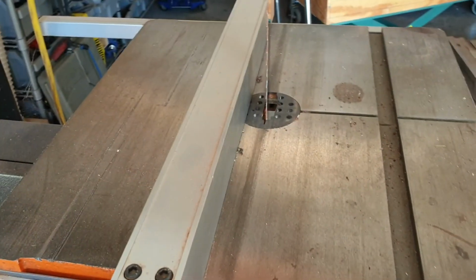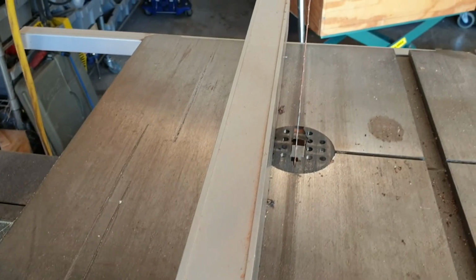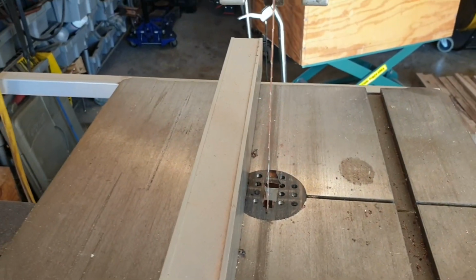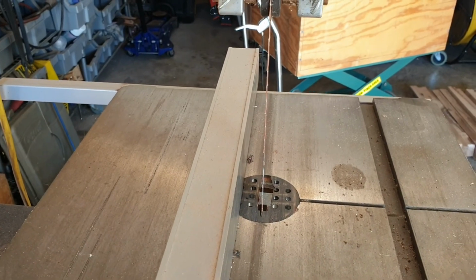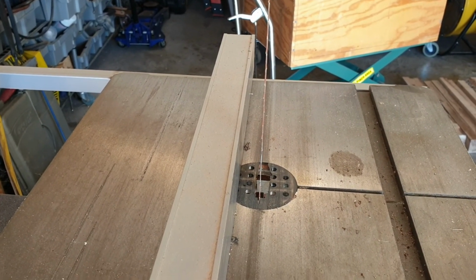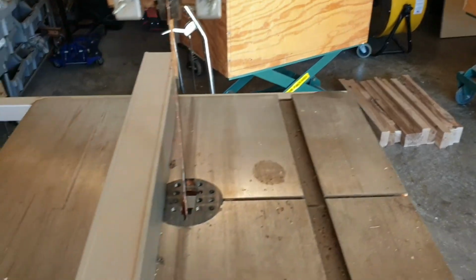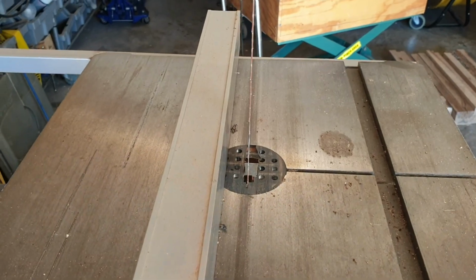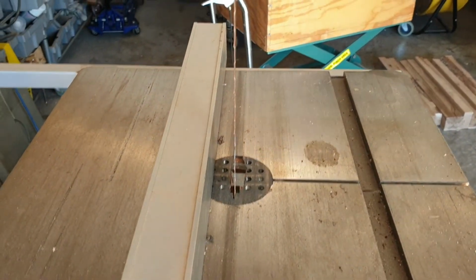All right, I'm wanting to end up with a 1/2 inch piece. Basically, what I'll do is make it 3/4, and then whatever planing I need to do to try and true it up. It's not critical on these boards. However, the part of the dovetail does remain on that, so I do want to get it pretty close to 3/4. And the ends of these boards that I'm cutting will bevel down into the stringers or the steps to lock them into place.